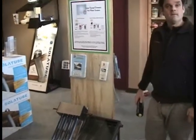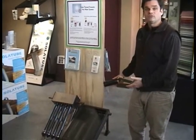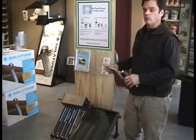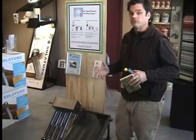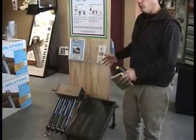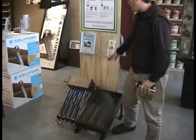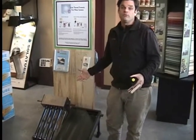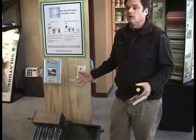Let's talk about cost and installation. The great thing about cost is that unlike a photovoltaic system which makes watts, this makes BTUs and transfers the sun's energy at about 95% efficiency, compared to a solar PV system that transfers the sun's energy to electricity at closer to a 17% rate of efficiency. These systems are really affordable because they're low-tech. Typically, this evacuated tube collector to heat all the domestic hot water for a family of four would cost about $8,000 — equivalent to about a 3.0 kilowatt PV array, which would be more like a $25,000 system.